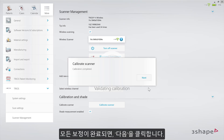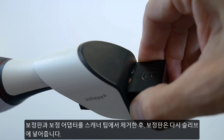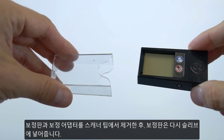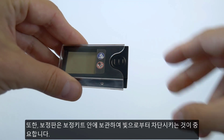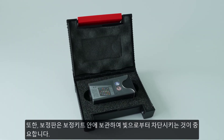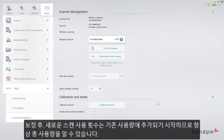Once the calibration process is completed, click Next. Remove the calibration target and adapter from the scanner tip, and put the target back into its sleeve. It is important to put the target back into the black box to protect the color target from light. Now click Close. After the calibration, the use counter will start adding the next uses to the existing amount, so you will always know the total amount of usage.